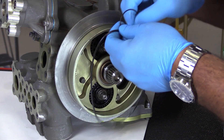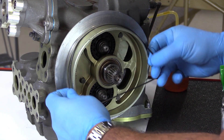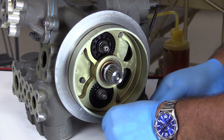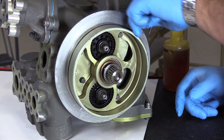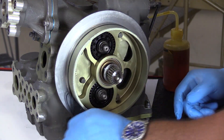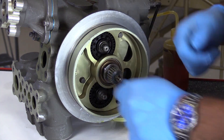I'm going to use my discarded O-ring material — you've probably seen that in other videos — and guide that packing into the groove with it. I'm going to make a couple of revolutions around it just to make sure that I don't have any twisting energy stored in that packing, which will make it last a lot longer.